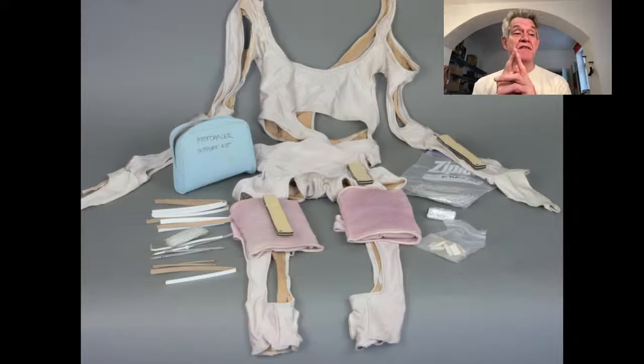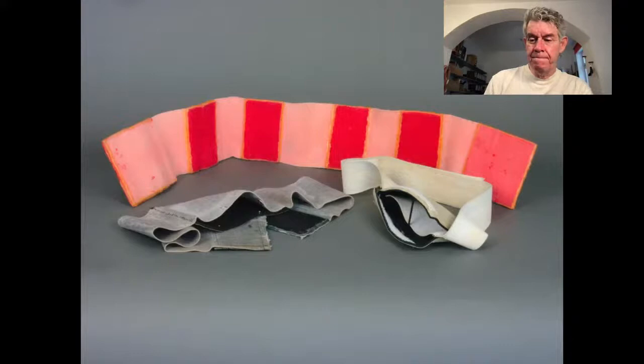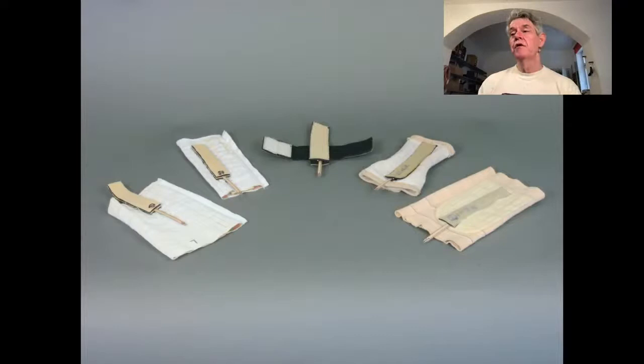I want you to look at the little brown strips of neoprene that you see there, and I think you'll see this in the next image too. Yeah, here we go. So you see these neoprene sleeves. Those were super important too. If you decide to work with these flex sensors, please copy this design. Again, this is all Dawn's doing. We just got 1/8-inch neoprene, and we made a little sleeve and hot glued it together and slipped the sensor inside. Why?